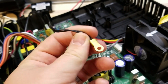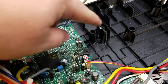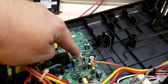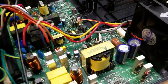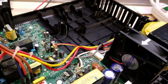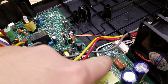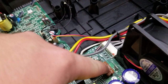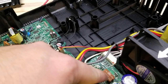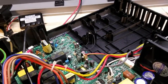I lopped off the potentially offending sensor and soldered on a big jumper right there, joining the two wires. Did the diode check to make sure we got connectivity between the two connections. You'll also notice some automotive blade-type fuses here — I checked both of these and they're good. They're soldered into the motherboard but I got connection between both posts, so those are good. We'll snap it all back together and see if it works.